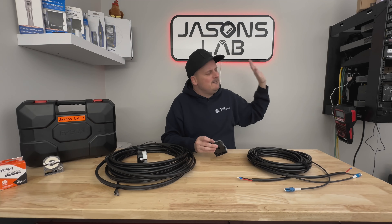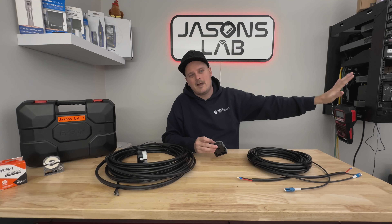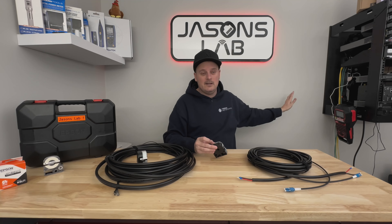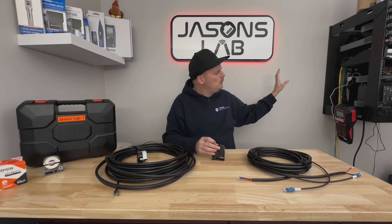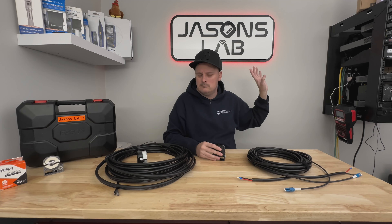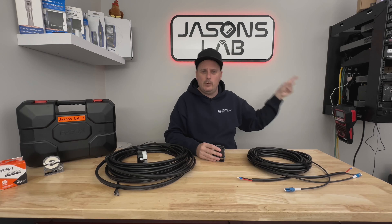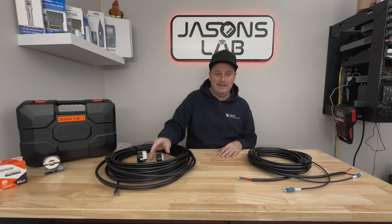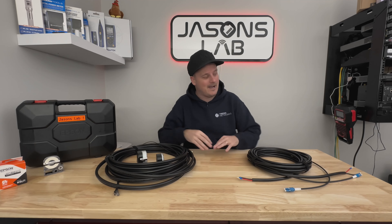Even inside the rack is just as important as outside the rack, because if you take the side off you need to see stuff. Where I got this idea: I was plugging something into my rack and didn't label it — bad. I pulled out the wrong cable, unplugged the wrong switch, and everything went down. So labeling inside the rack is just as important as labeling outside the rack.